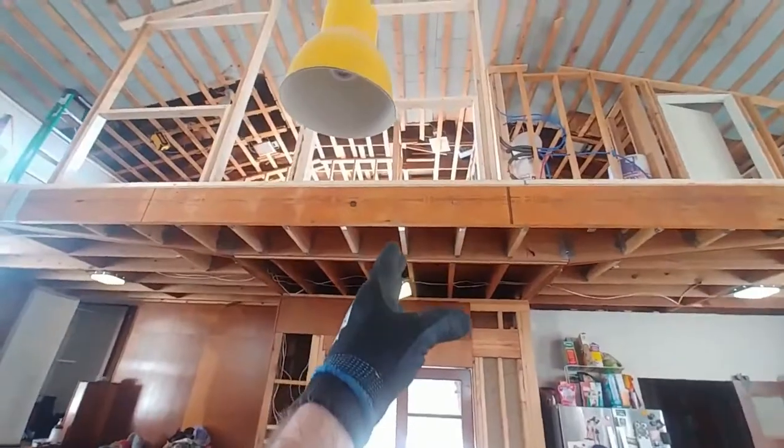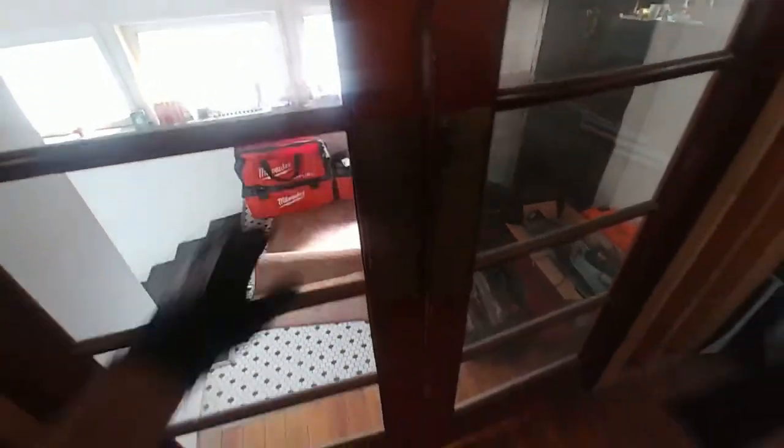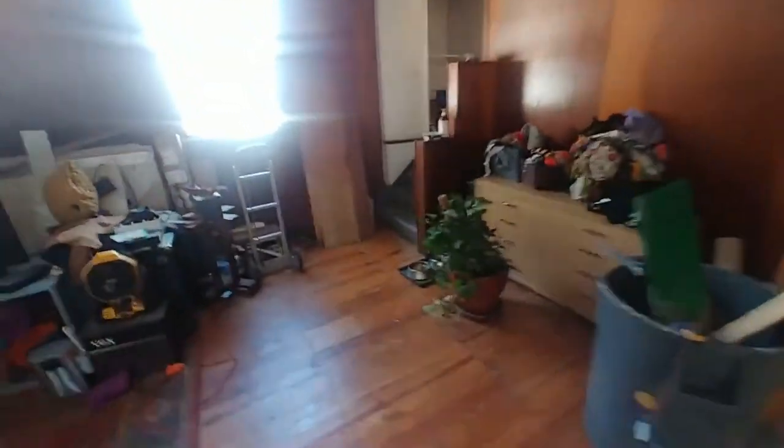And I backed off with the laser level, okay, and I put the laser line right through that line on my floor over there, and it goes on up, and it's, you know, on the front of the beam up there. I'm not sure if you can see it, but ultimately it's also on the door on the way by. And this is a 60 inch door opening, so at 30 inches is essentially where the gap is in the door. And if you can see there, without me getting in the way of it, it's right on the gap of the door, and it's right on that rim joist upstairs.